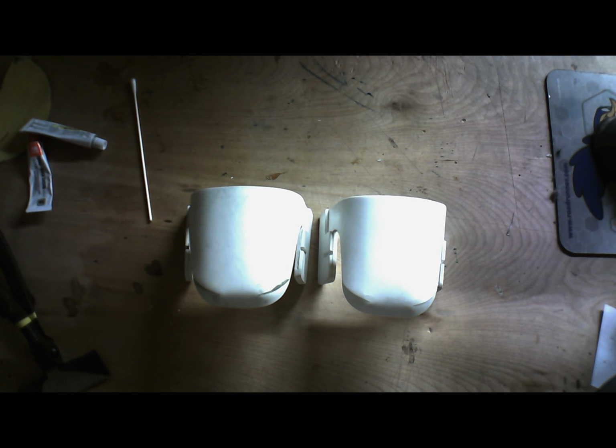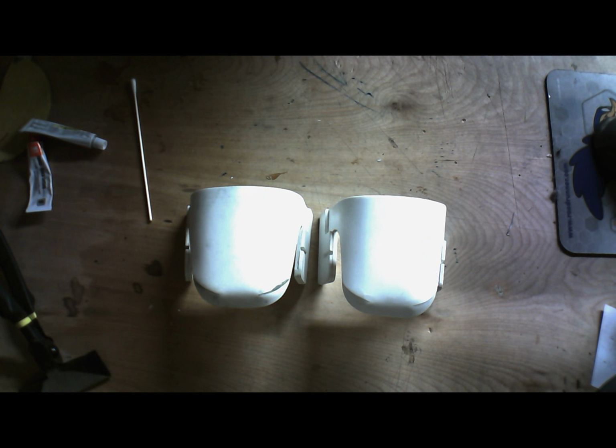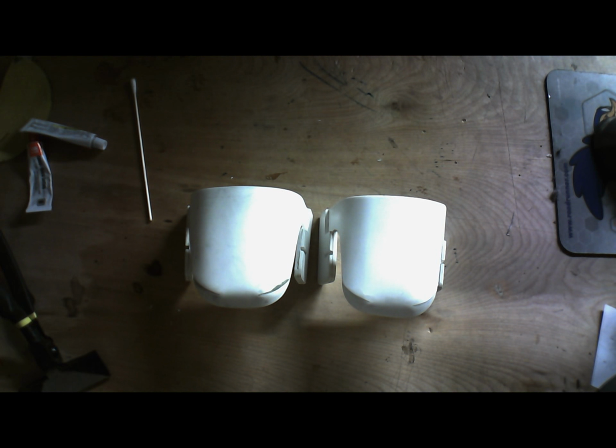One thing I want to mention about epoxy: do not try to dry it fast using a heat gun or anything of that nature. All you're going to do is cause the epoxy to run. It won't kick off. It'll be too hot. You'll basically scorch the epoxy. Don't do that. Let the epoxy dry on its own time. Some corners can be cut, but that's not one of the corners that can be cut.